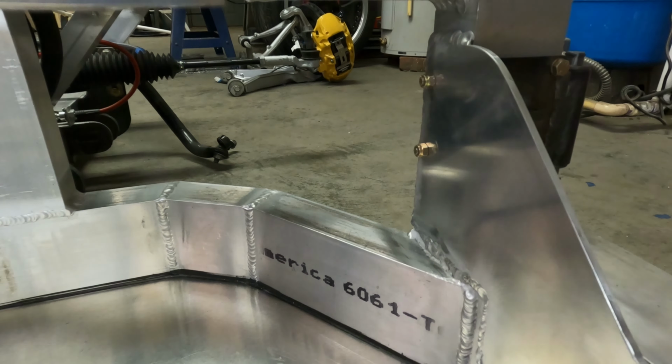strengthening or bracing these top supports here for the shock towers. And I have my tubing here for that. It'll be this piece. I took the measurement. I need to cut these into 5.5-inch pieces and then cut them and fit them to put as doublers in there and weld those in. That'll possibly be next week. That may carry over into the week after the roll cage tube pieces come in.